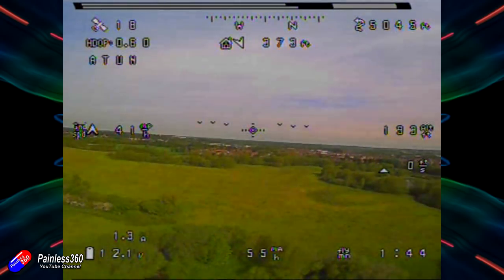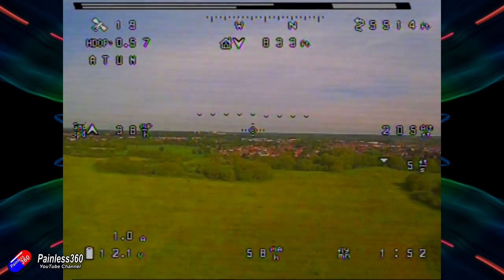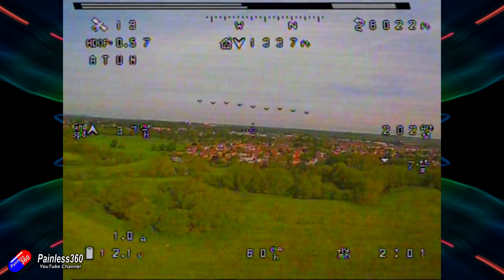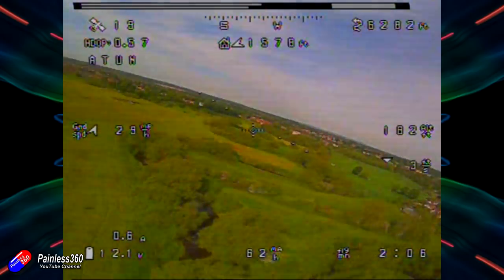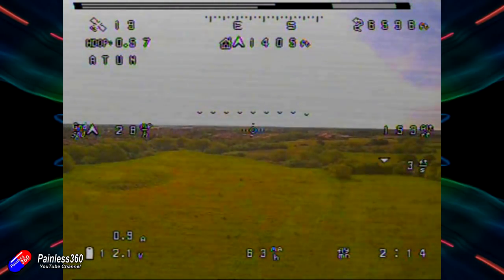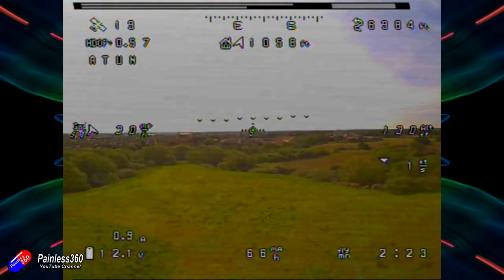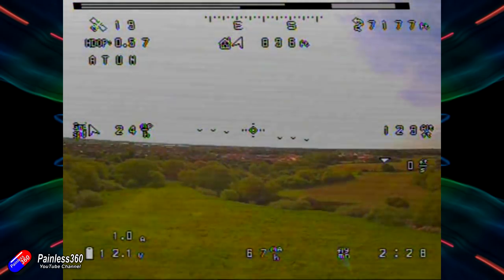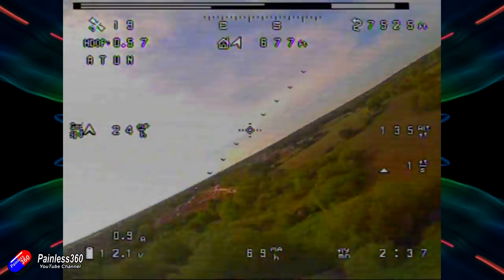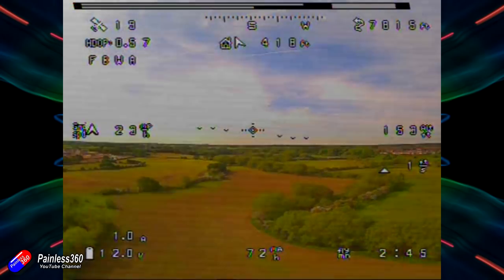What's happening is the PIDs are being tested and the software is iteratively figuring out what PIDs are needed to get the commanded movement and actual movement as close as possible. You're supposed to do this a minimum of 20 times — every time gets you about 5% closer to the perfect tune. I'd say do 20 times, fly around a bit, then do another 20. It saves settings every 10 seconds, so if something nasty happens you can take it out of auto-tune and it reverts to the last saved settings. I did get a really bad wobble in pitch and started to panic, but continuing to fly let the controller modify the PIDs and it settled down — so don't panic.